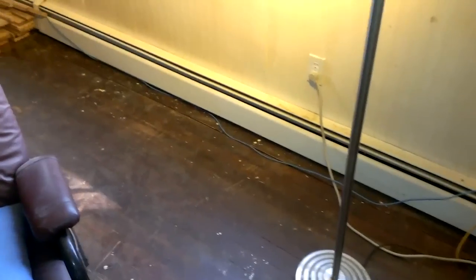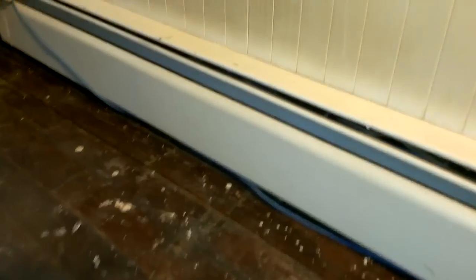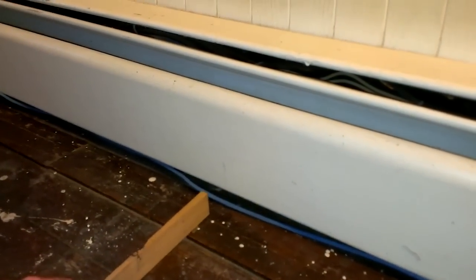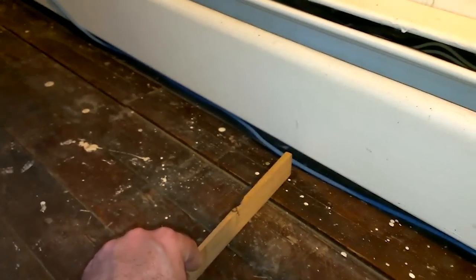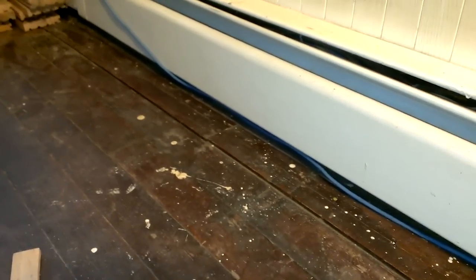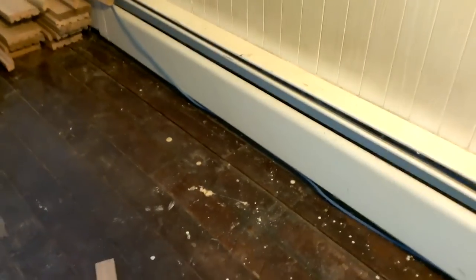That's the final fix — the foundation is solid enough so we're going to leave it, and we have this extra support. Let's go up and take a look at the end result. Here's the floor along the back wall — if I bring a piece of wood over here, you can see the floorboard is essentially flat now. There's still a little separation to fix, but it's now essentially at level again. This is remarkable because this floor has not been flat in 100 years — I've never seen this floor flat, and now for the first time it's flat again.